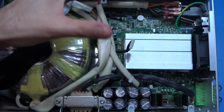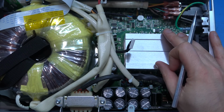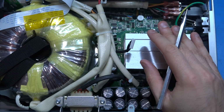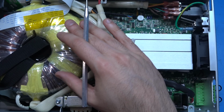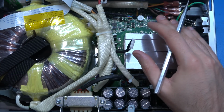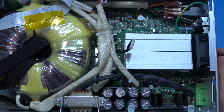There's another transformer here powering perhaps a few other things. Now the compactness of this is impressive for the kind of functions you're getting. But remember that this heatsink doesn't need to be very large. With good design of the power supply and different taps that come out of the transformer itself, you can minimize the dissipation on this during operation as a power supply. This doesn't sink a lot of current into it, so when it wants to discharge a battery, it doesn't take a lot of current, so it doesn't need to dissipate a lot of power internally as a load, for instance. So this doesn't need to be very large. But overall, it's fairly quiet also when it runs, and the fan has a dynamic control, of course, on top of everything.